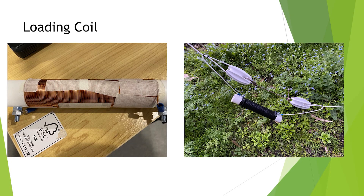So in this next slide, this is the loading coil. It is basically a 25mm former with 120 turns of 1mm enameled copper wire. I wound that by hand — I didn't have a winding machine. I have seen people use a larger former, 50mm diameter with fewer turns, and instead of enameled wire you could use insulated wire. You could also use a smaller former with more turns if you really wanted to.